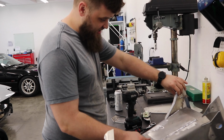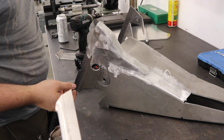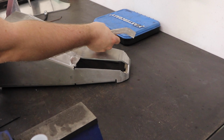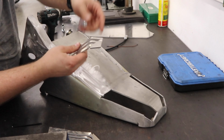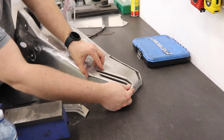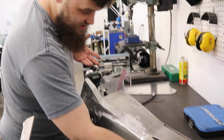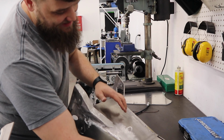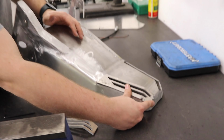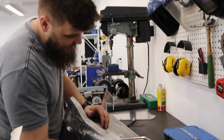Yeah, still need to replicate this stuff on the opposite side and weld in these pieces for taillight. So those look so sick. And you're doing a 3D printed taillight behind there? Yes, that is the idea. I might have to cast these lenses out of resin just to get it to fit properly. Otherwise I'll print them oversized and then sand them to fit. Cool. So that's the idea.